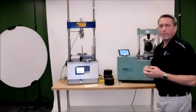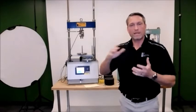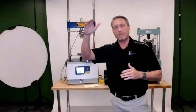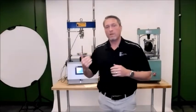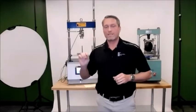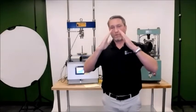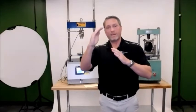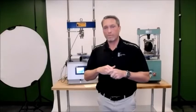Now the Pine press is programmed just to run a certain amount of length and stop. When you're doing your TSR test, all you're looking for is that peak load number out of the test. One of the important parameters of the ideal CT is that it gives the complete area under the curve, and that the test stops when the pressure reaches 0.1 kilonewtons. What it's looking for is that peak load, and then the displacement from the peak load at 85, 75, and 65% of that load. So those are very important parameters.